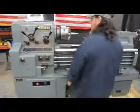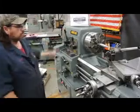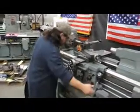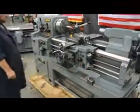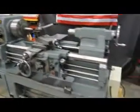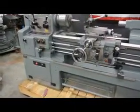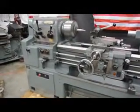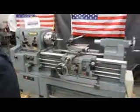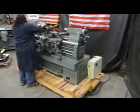You'll see he's stopping it with the foot brake and engaging it with the lever. We're going to do a spindle speed change here. What RPM are we running, Frank? This is top RPM of 1800. You'll notice how fast and easy and quick we're fired up. So that being said, we ran through a couple of spindle speeds and checked everything out on the phase converter.